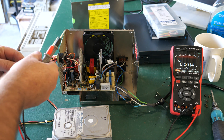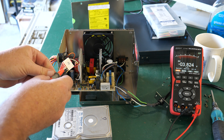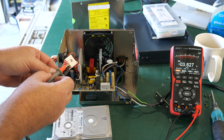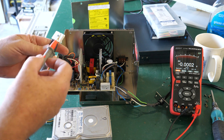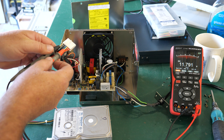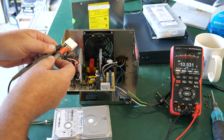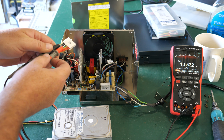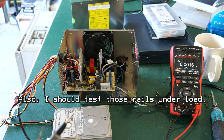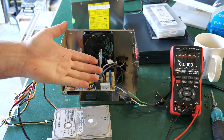Let's see what we have on these rails. Look at that — perfect five volts on that rail. OK, the negative five is down. Negative five is sitting at negative three... negative four volts. That's not great, but not a lot of stuff uses that negative five, so we might be OK. Power good — is that five like it should be? How about 12? 11.7 — perfect. Negative 12: negative 10 and a half. So this power supply is definitely not perfect, but it is OK. There could be some capacitors that need to be replaced or something. I'll take another look at the board, but yeah, this thing is up and working. No problem, now that the danger is gone.